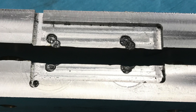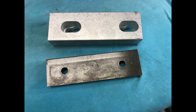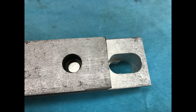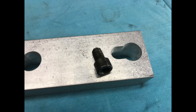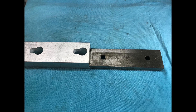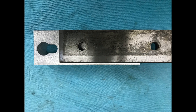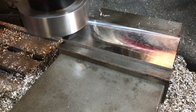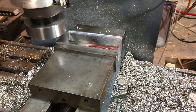A few days later, a very heavy box arrived. These holes are not exactly in the right place. Maybe my vise is not an exact clone of a Kurt. It's a very good vise, but the holes are definitely in the wrong place. Not only that, these holes look very large compared to those in my vise jaws. Fortunately, the distance between the holes was the same as my vise. I need to do something about the size of the holes and also the distance from the edge. I solved the distance problem by surfacing about 50 thousandths off one side of each of the five pairs.